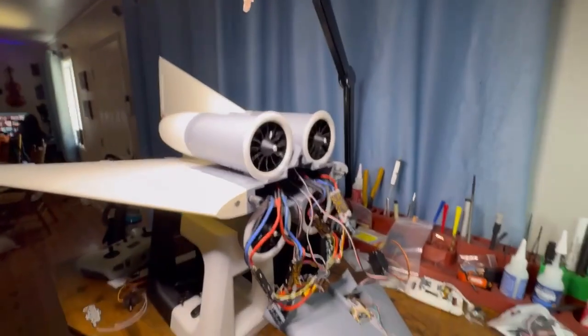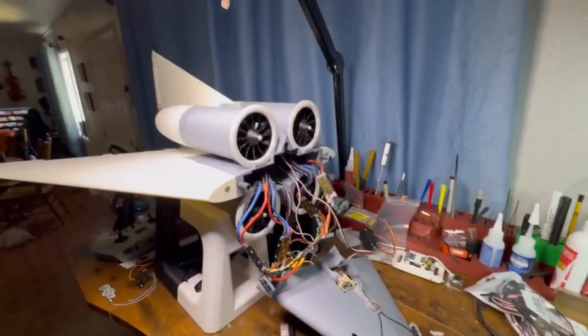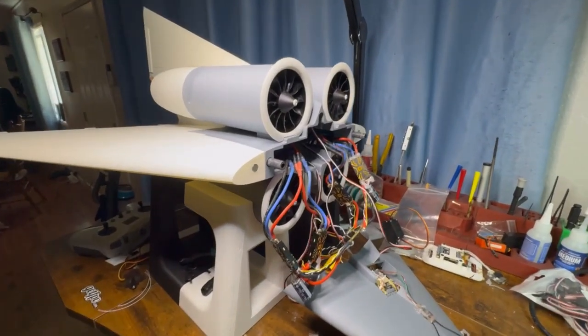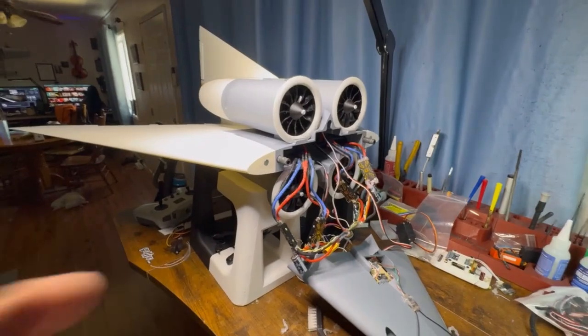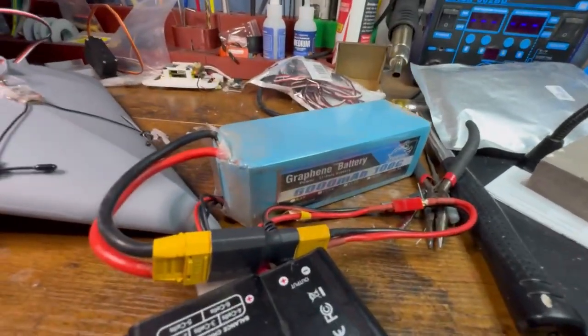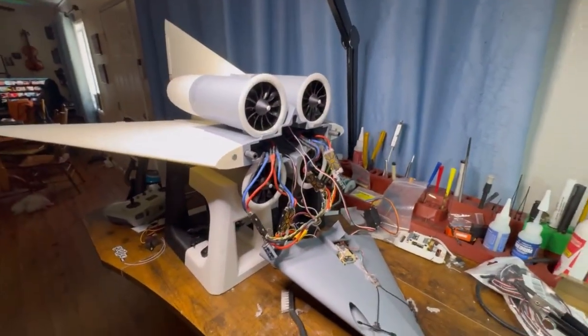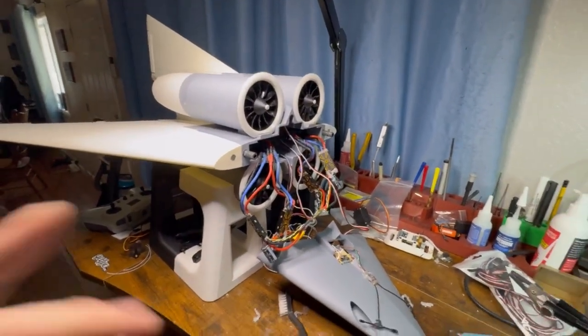Hover test is next after a charged battery. I'm going to order another battery just so I have one on hand, in case I did any damage to any of the cells with the high current amp draw. I can't find a 6,000mAh like this that's 150C — that would be optimal for me. 120C I could get away with, but 150C would be nice.